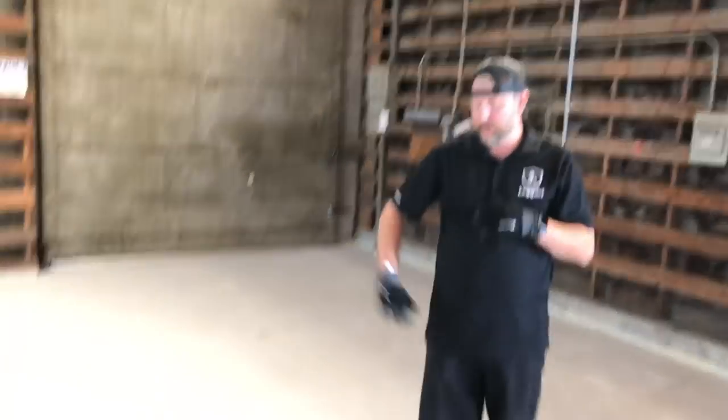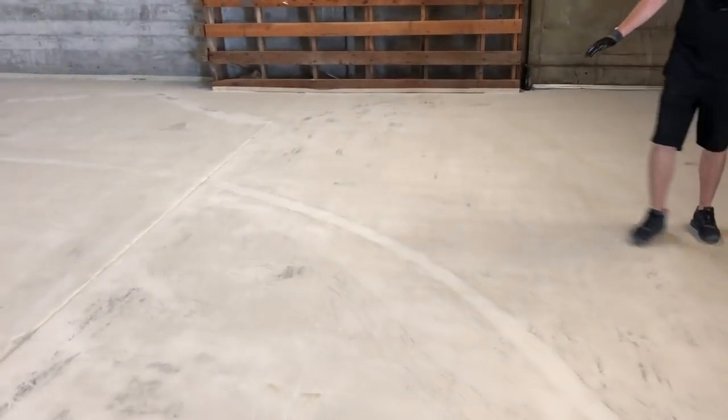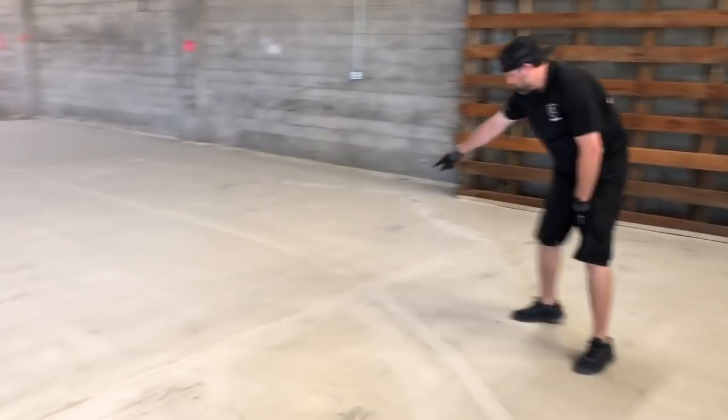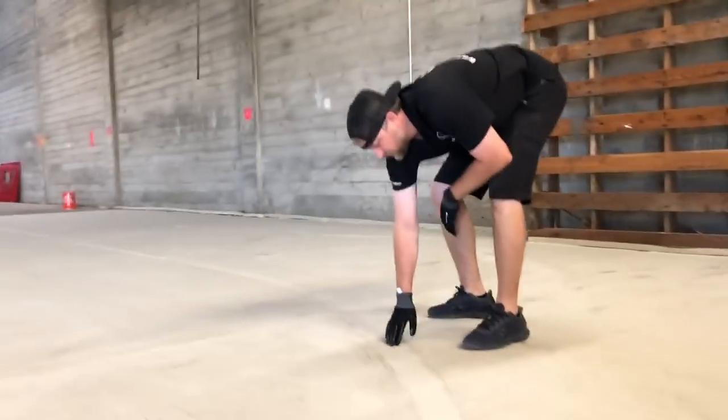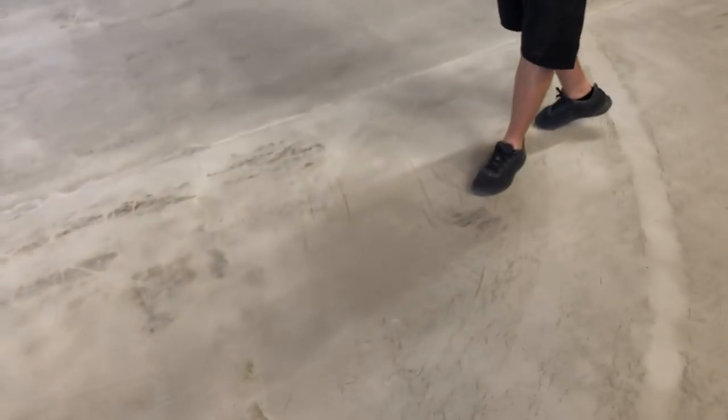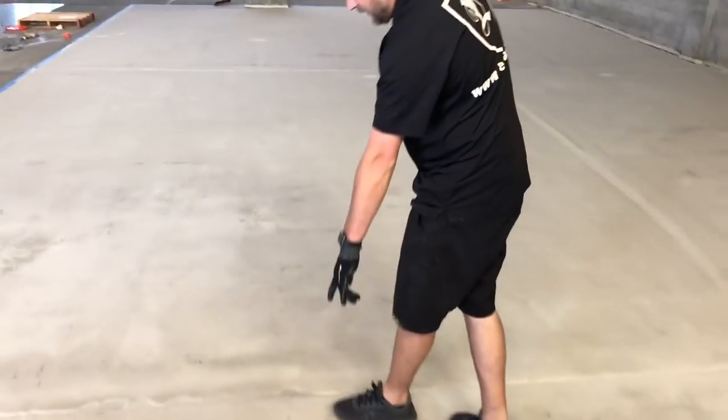to create a layer that we can scratch the surface and kind of fill in everything. Like, here's the trough. See how much different it looks right here? Because it's filled in a deep area of the concrete. And then all out here is just kind of where we scratch coat it. We pulled it tight. It's filled in a lot of cracks.